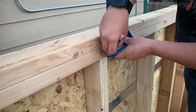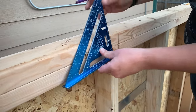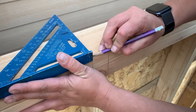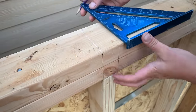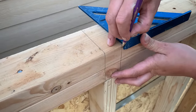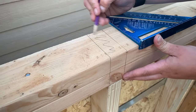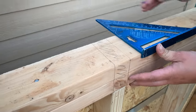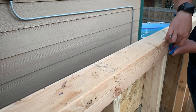Maya is going to mark out where the studs appear on the top plate. We'll transfer the location of those up the side and across the top of the top plates because we want the trusses to be directly over the studs. That way we have direct load bearing all the way down to the ground and the top plates won't tend to bend or flex under heavy load like deep snow. It's just traditional to put trusses directly over the studs.